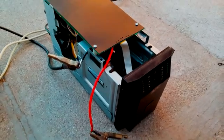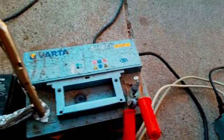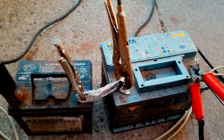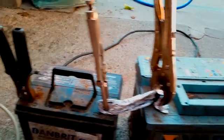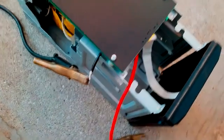I'm going to test it out. You have this jumper cable — it's connected to the positive connector of the UPS, where the UPS battery would normally be. That wire goes all the way to the positive connection of the car battery. Because this UPS takes 24 volts, I'm connecting it in serial with this battery, using aluminum foil to get a good connection, and then these two welding pliers to keep the contact good. Then another jumper cable from the negative of the lawnmower battery goes back to the negative connector on the UPS.